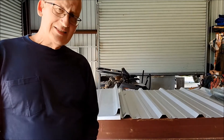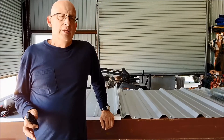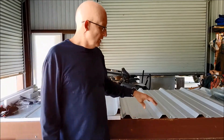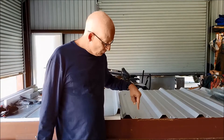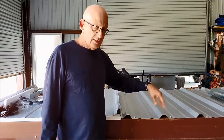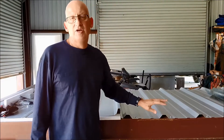There are three basic types of metal roofs you're going to find on a metal building. I've got two of them here and we can extrapolate the third. The most common thing you'll see is called an R panel — a 12-inch on-center rib, exposed fastener panel, meaning it's screwed right through the panel directly to the purlin. These panels are three feet wide and come in 24 and 26 gauge. There are all kinds of versions of R panels, but this is very, very common.